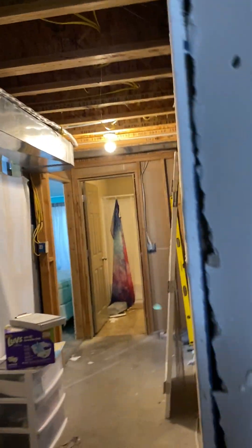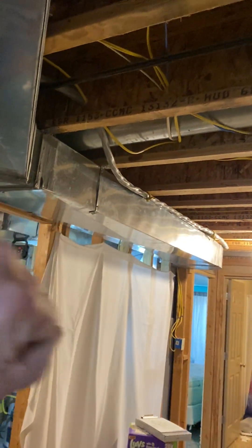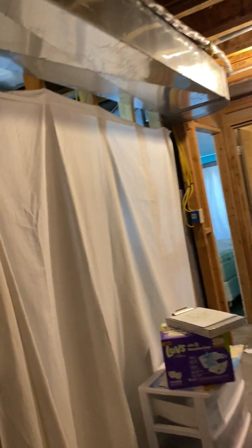Going all the way over into that one puts it right next to the wall; this one kind of puts it over the window; in this one it'll put it right here. I'd say go in this one anyway — just slide the pipe down alongside the sheetrock like the last one. Put the boot on the end of the pipe, slide it down, put another piece of pipe on, slide it down, and hopefully you make it to the end. For the return air, put an 8x8 as close to the door as we can — 8x8 flat.